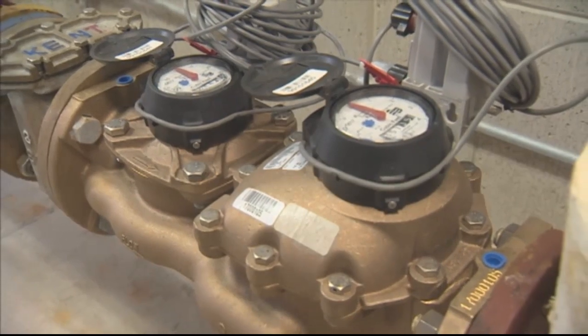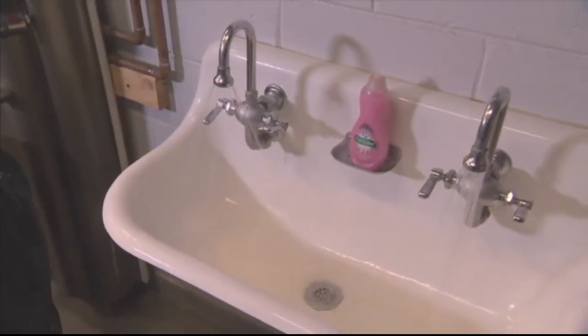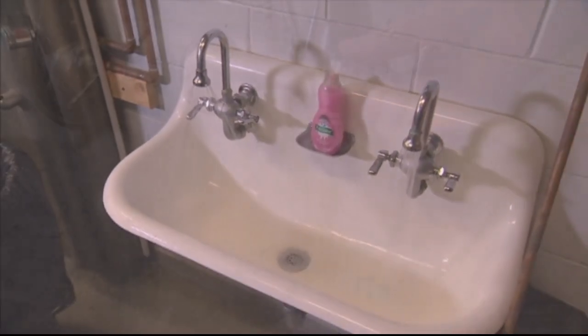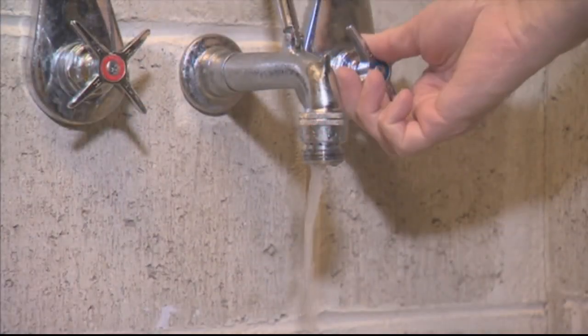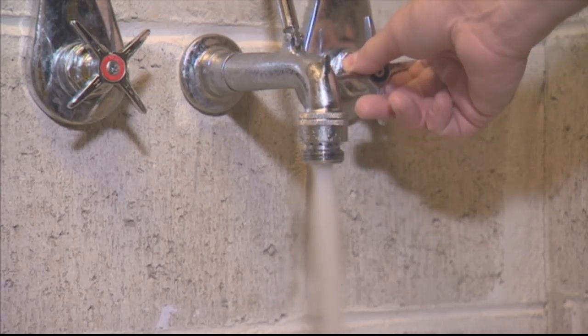And then you start at a specific area where the water comes in, say a janitor's sink? That works ideally. Because there's a high flow rate of water when you open up that faucet, a lot of water comes out there very quickly. So we can flush that water out to that point. We know we have a good fresh start from there.